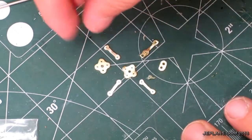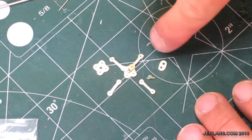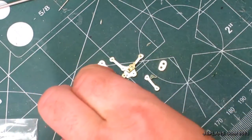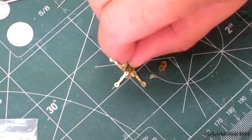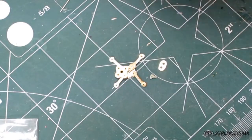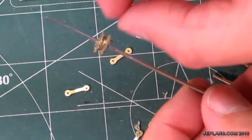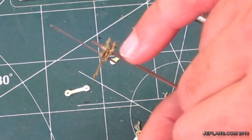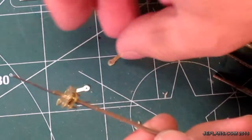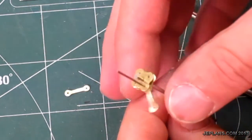We have the pieces cut out here. Here's a small sanding disc to clean them up. They'll assemble something like this. One piece always needs to be fixed on a rotary-type engine in the middle — it'll go together and this will be sandwiched on top. I'm going to attempt to put a little drop of solder in here just to keep things pinched tight together, and then I'll be able to take the pins out, put the other connecting rods in, and have my main connecting rod assembly in the middle of the engine.